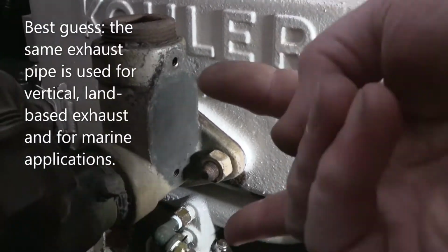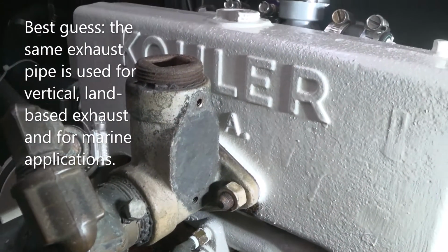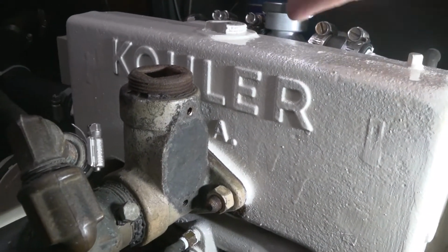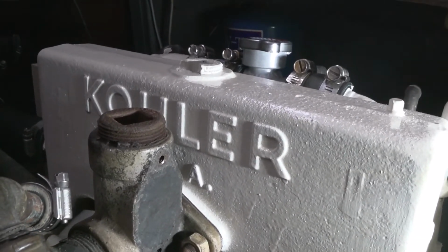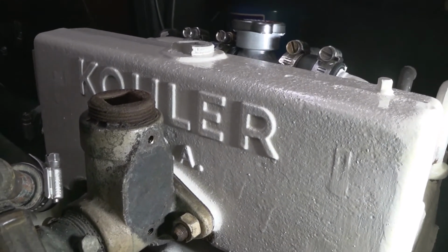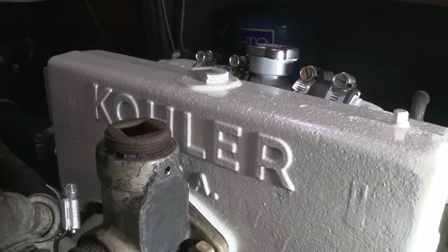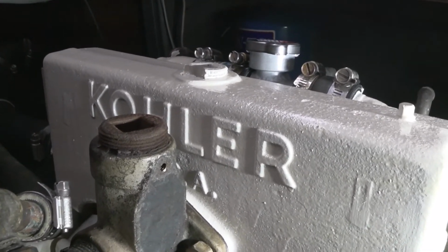And in any case, without that choke attached or screws in here or something, all kinds of exhaust gases will come billowing out of those 2 holes. So I'm going to get those plugged up, and I'm going to do that by reinstalling the choke, but without the arm actuator in place. And that's the plan.